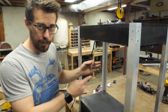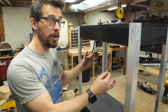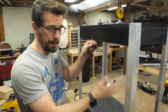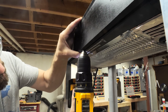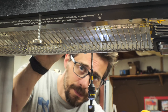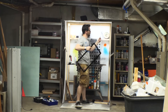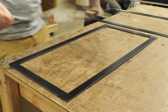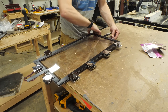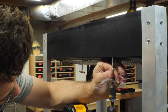The paint on the frame is drying so we're going to go ahead and make the mounting points to hold the frame in place. I'm going to drive in two screws — one on the front and one in the back right in the middle — so that I can use the 12 by 24 frame that I made or make a smaller frame for smaller material in the future. I'm going to drive in this screw up to the right height and then put a rare earth magnet on the end of it. That way the metal frame can snap right onto it and when the plastic is heated up I can grab it and pull it right down. I ordered some styrene to test this with but it didn't show up in time, so instead we used some really thin plexiglass that we got locally for the first tests. I put it in between the frame pieces and used some binder clips to hold the whole thing together. I slid it up into the frame and quickly realized that two magnets was not going to be enough, so I decided to go ahead and add four more to make sure there was plenty of magnet surface to hold the frame into place.